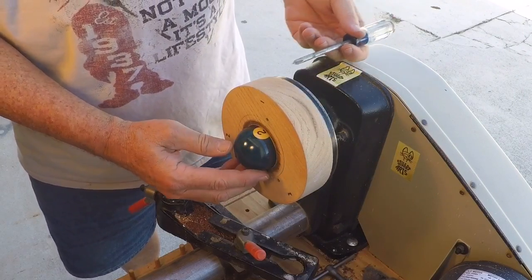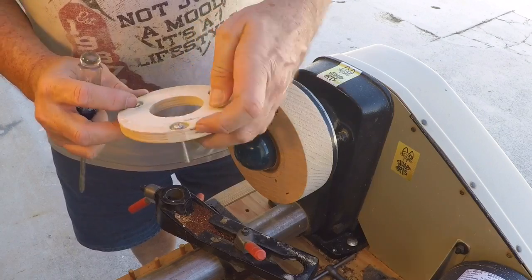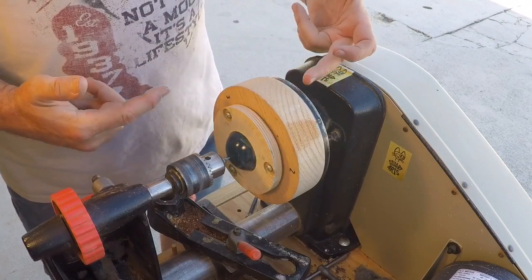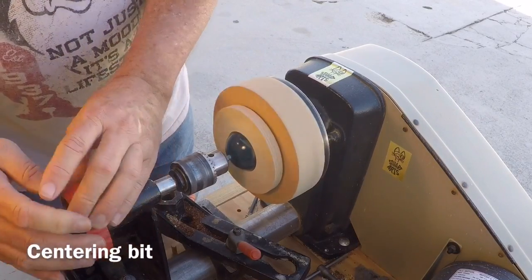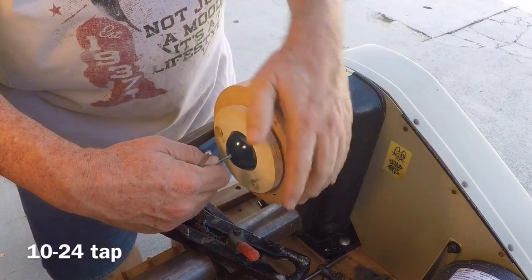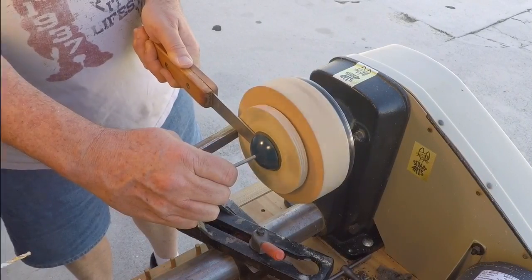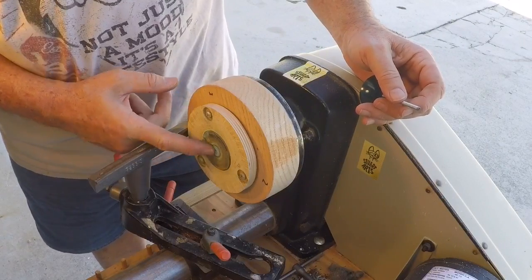I've got my two-ball held in place in the base of my chuck by that 10-24 screw that comes through the center of the base plate. I've got this little flange and I'm going to screw that on, then drill a hole into the top. That'll give me a nicely aligned hole on the top and bottom, pretty much 180 degrees out from each other. I'm going to part this top section off the ball. There's a fair amount of heat checking on both sides of this cut.